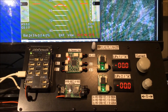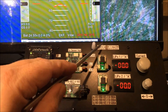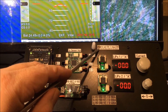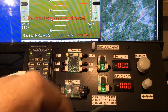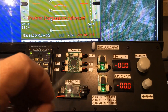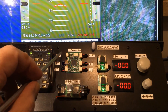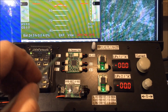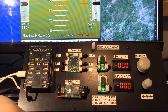So that's basically the function of the board. For alarm IOs, we have a 5-volt 1-amp output for any LED, booster, or whatsoever, plus one free relay contact you can connect to any input of the flight controller to initiate a Return to Home — RTL. A further option is a UART output to connect a display to read out the individual currents. Right now I'm developing this display — I hope it comes out soon. Any questions, please feel free to contact me at any time. Thank you very much for watching.